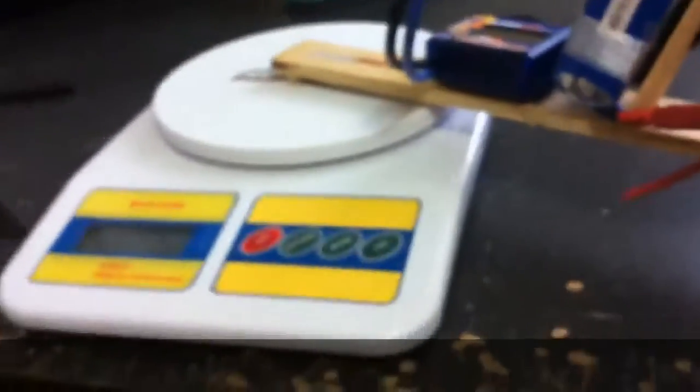So we're down to 12.4 volts here, but should run just fine. Just the same. As you can see, about 700 grams continuous thrust, and just under 20 amps, which for some reason is slightly lower than what the stock prop was doing. And I even tried switching out the stock prop with the spare that it came with, just to see if that was a bad prop, and nothing really changed.